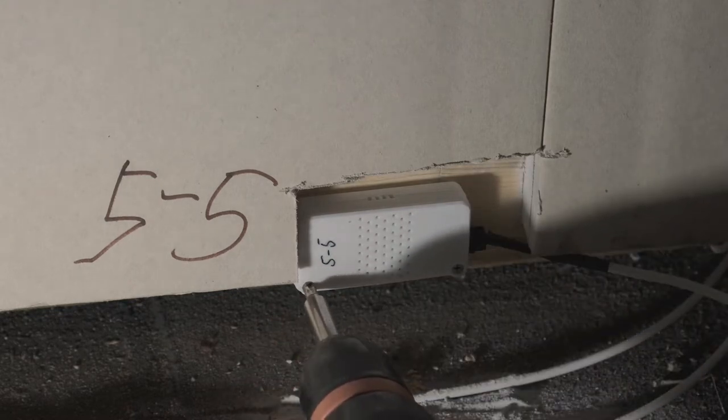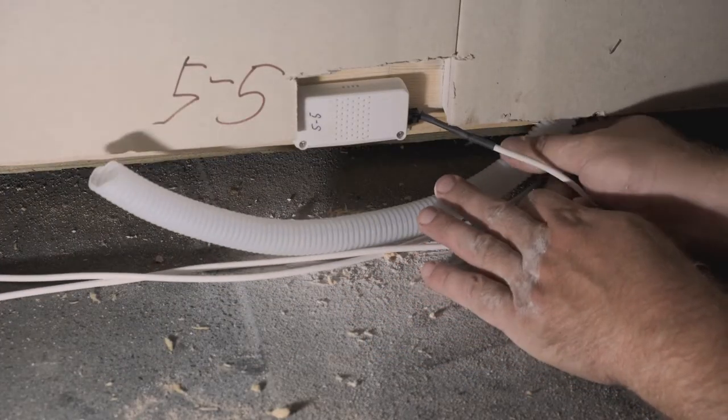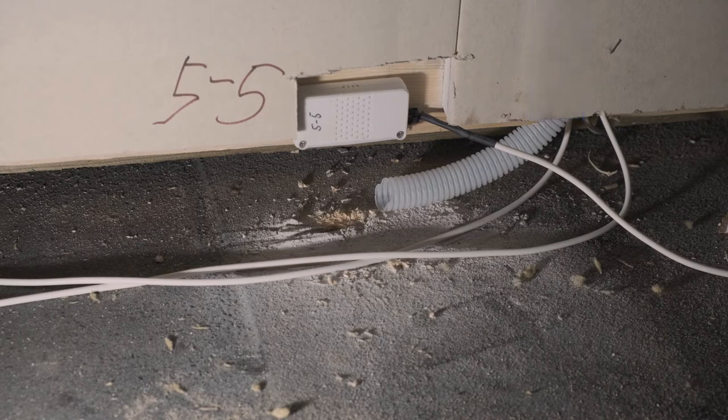We recommend to use a protector for every sensor. This allows you to inspect the space using, for example, an endoscopic camera, without the need of any demolition works. In this case, install the cable around the protector towards its upper edge, where you should form a loop and fasten the cables.